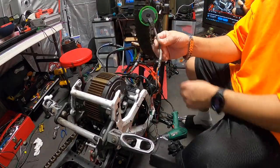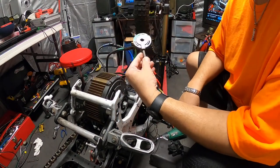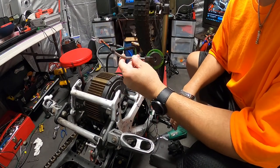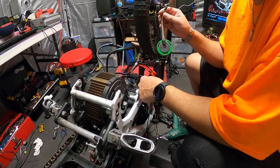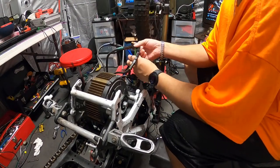This is the old hall sensor. When I tested it with my multimeter, it didn't test good — it tested bad. So I put a brand new one in it, and I'm pretty sure it should be working when I power it back up. No doubt about it.